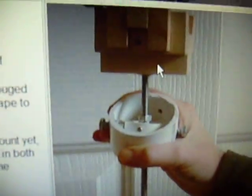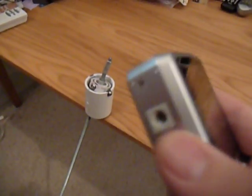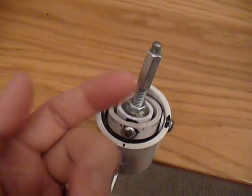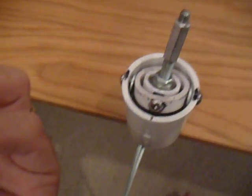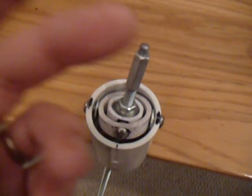He's also using this weird wooden mount for his camera. Since most cameras have this quarter-inch, quarter-20 thread on the bottom, what I ended up doing — he's using the 5/16 thread — I made my own little adapter to adapt to the quarter-20. I just bought a common spacer, not even threaded, and drilled the size into it and tapped my own threads.